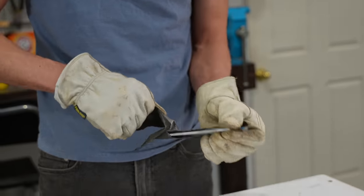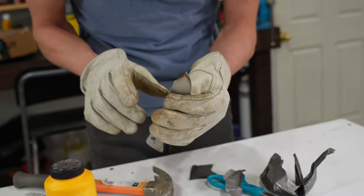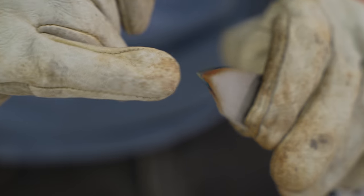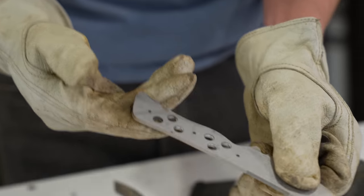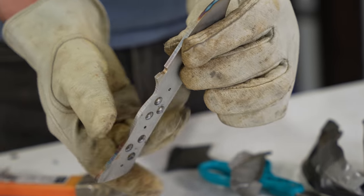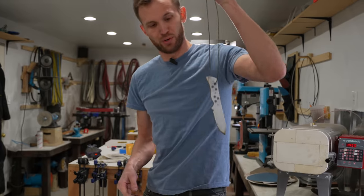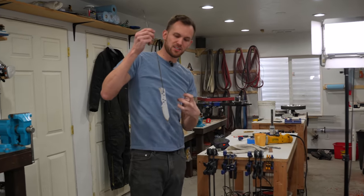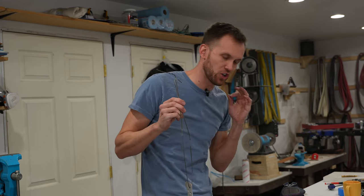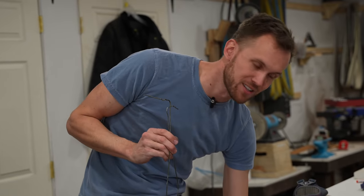It looks like I probably had a tiny hole poke in the steel from the sharp edges on the tip of the blade, but that's not really going to be a problem. It's nice and straight, everything's looking good, just a tiny bit of rainbow patterning. Now what I need to do is cool it down a lot more in liquid nitrogen, and I'll put it in a liquid nitrogen dewar. All of this is to help the crystalline formations inside the metal form just the right way to get the perfect blend of hardness and flexibility.